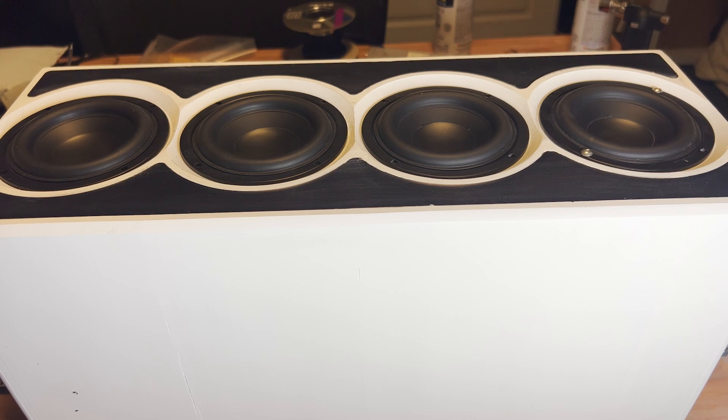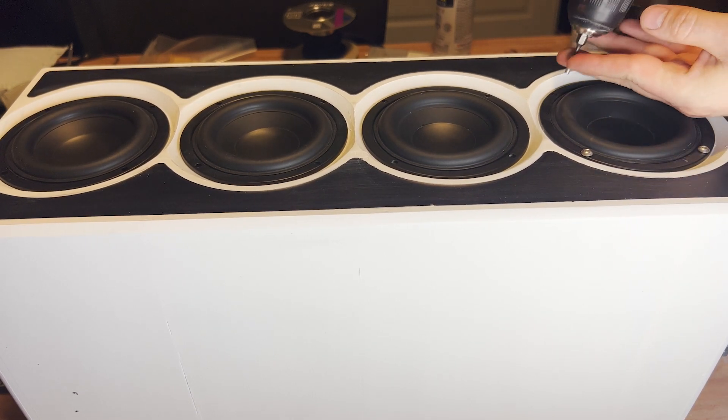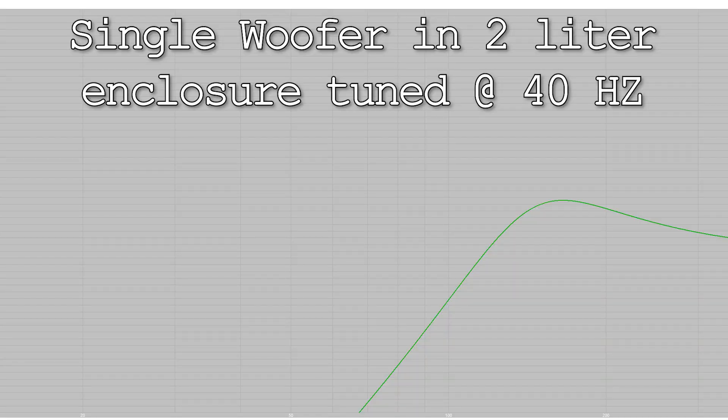I took advantage of the line between the speakers to hide the seams, so it's very hard to tell there are four separate boxes. Using four drivers instead of one larger driver saves space — the enclosure is only about six to eight inches wide. In a general bass reflex design with just one subwoofer, you get kind of a one-note wonder that performs well for one frequency and falls off within about 20 to 40 hertz in either direction.